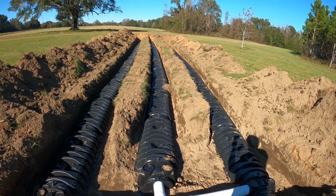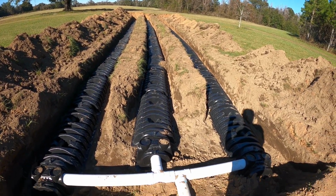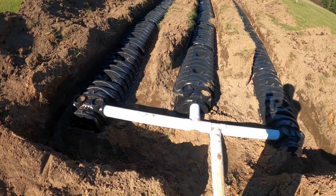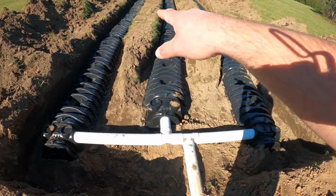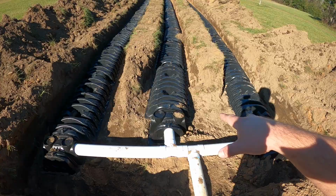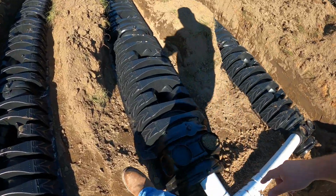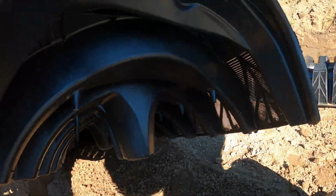And believe it or not, this drain field right here is actually oversized for our house, but we did that for a reason I'll talk about in just a second. So long story short, the liquids come out of the tank. They then separate into 3 different drain fields, and these are what's called infiltrator panels. So they're relatively hollow. You can lift them up. As you can see, nothing to it.